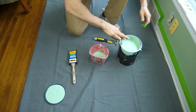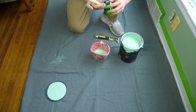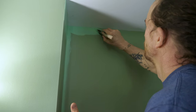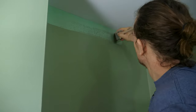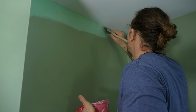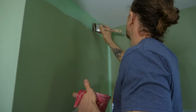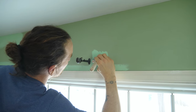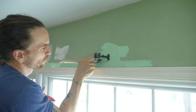I filled up my cut-in tray and grabbed a two-and-a-half inch angled sash brush — I like them stiff for cutting in ceilings, just a polyester blend. First I go and cut a really sharp line, then brush it down about six inches. That gives me just enough room to roll up near the ceiling without ever hitting it. Cutting in around little things like curtain hooks requires a high-quality brush for control.